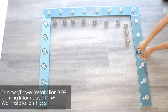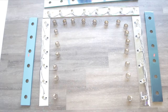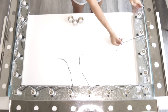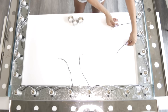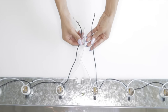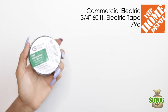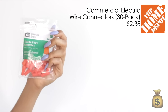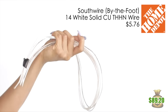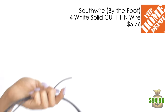First you're going to lay out your vanity strips and remove the metal sleeves that hold the vanity in place. Each vanity strip comes with four exposed wires that are placed in the center — you have those on the right and then the four exposed wires on the left, each with two white wires and two black wires. For the next steps you are going to need some electrical tape, wire connectors so that none of the wires are exposed, some extra white wire which you can buy by the foot, and also some extra black wire that you can also buy by the foot.